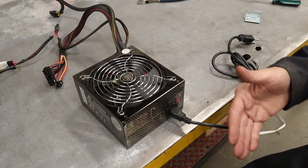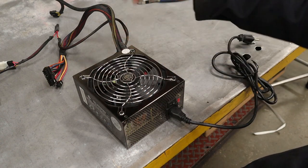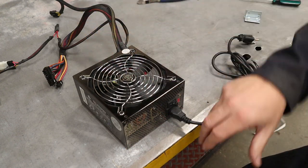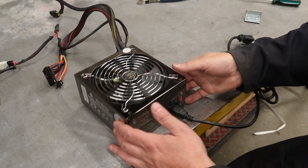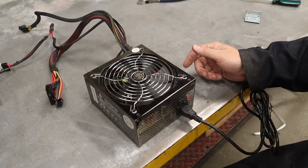This is the plug for the back of the computer. So this means this is the hot air on the outlet side, and then this big fan is actually the inlet side. So how you position this, you're gonna wanna make sure that it's the same airflow that's going through your cabinet. So I would aim this towards the back of your cabinet. And then the other sides, they don't have any kind of holes or screens, so that means those are free to put against any side of the cabinet where you have it.